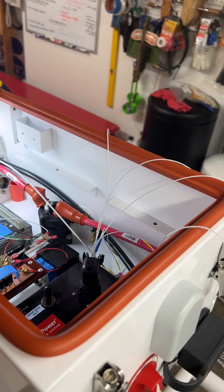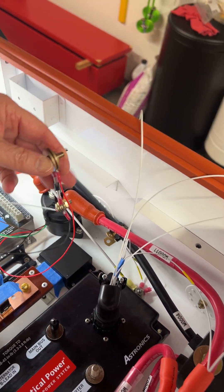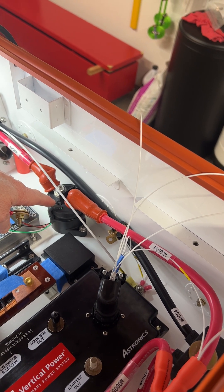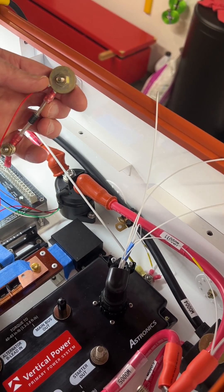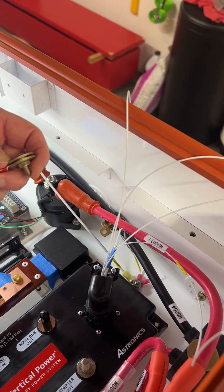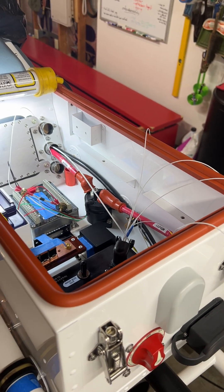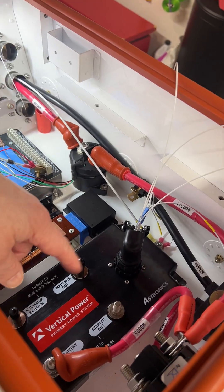In this test, I've eliminated the PPS from the starting circuit completely, and I'm just going to go ahead and see if I can get the engine to turn over and for the start cycle to complete, simply by powering the contactor. I've got that flyback diode installed in the circuit, and I'm simply going to touch the screw here to the positive battery terminal of the manual battery switch, and we'll see if the contactor wants to drop out. I'm curious as to whether or not that is causing the PPS to trip.